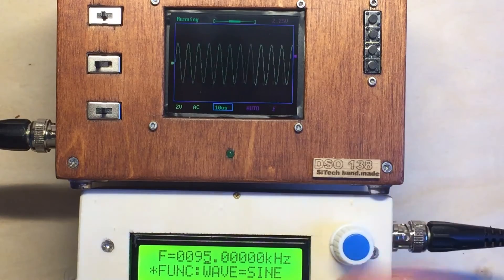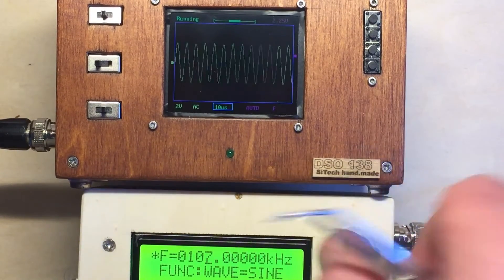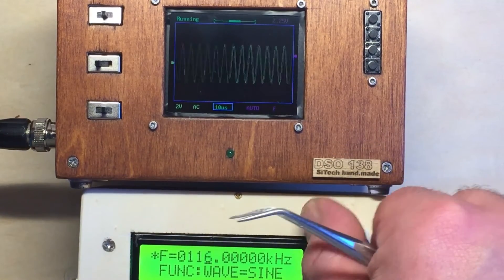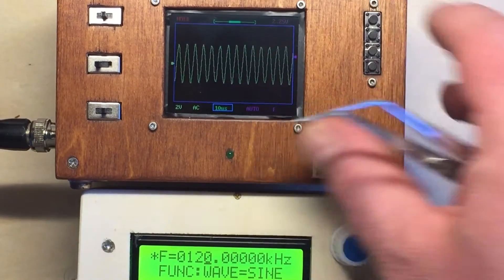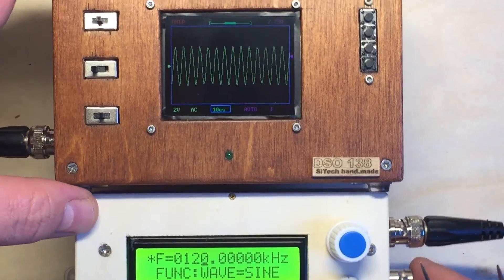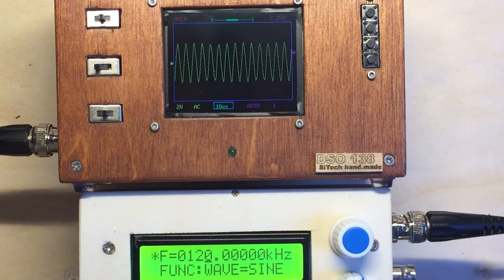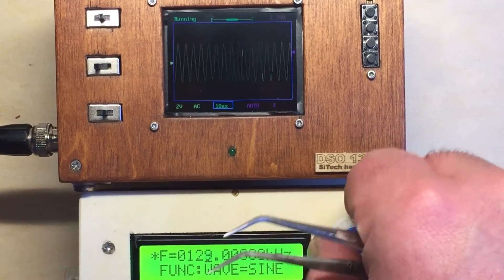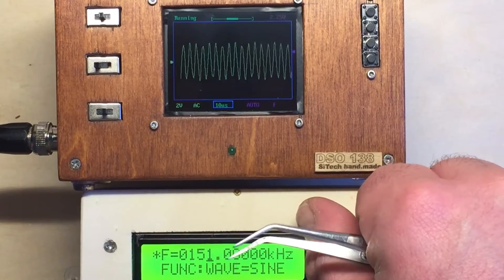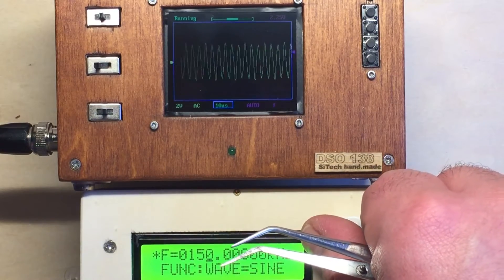So it's okay for me. Going up to 120 — I use the hold button. It should be a sine and it still looks like a signal, but it's really not very precise. Let me try at 150. Yeah, it's really jumping around a lot. Now it starts to get funny — I press the hold button. You see, you'd expect each of these lines to be at the same height, but this is higher than this. This really doesn't look like a sine wave.